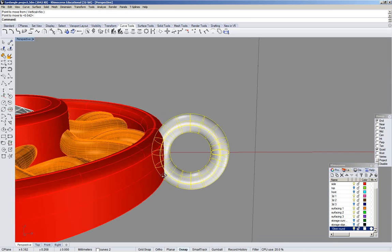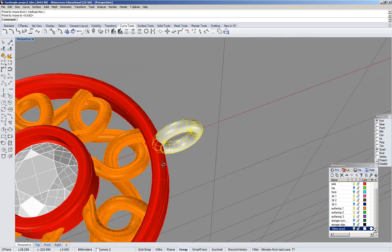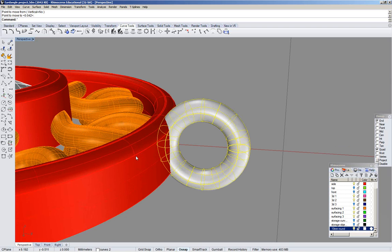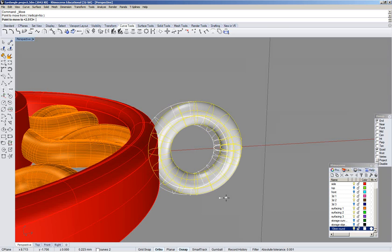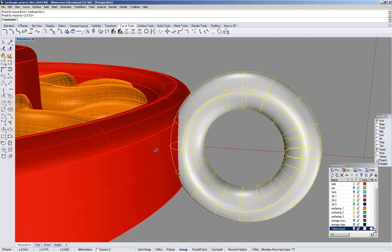But what I don't want is I don't want to see it bite in up here. So what I need to do is back that off and respect where this curve begins. I want it not to bite in much above that. But I have to have a good solid union, a chunk of metal going in, so that the casting will flow properly.